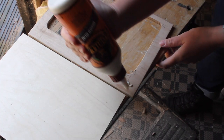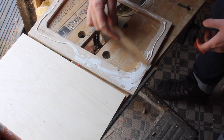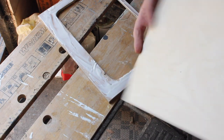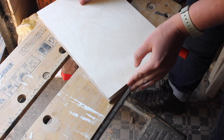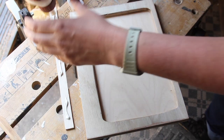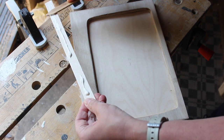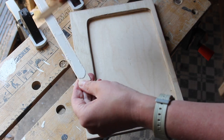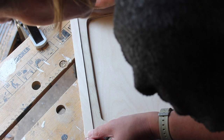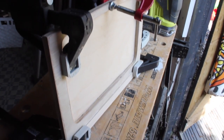Then it's time to start gluing it all together. Apply a generous amount of wood glue to the back of your thicker piece of ply, spread it out, and line up one of your thinner pieces of ply — make sure the prettiest looking side is on the inside of this laptop. Pop it on top and make sure it all lines up perfectly. Flip your laptop over. I'm also gonna glue the 2 centimeter strip to the back of the laptop. Apply the glue, spread it out, line it up to the back bit where you have 4 centimeters of thick ply. Make sure it lines up perfectly, then clamp it all together and leave it clamped for a few hours so the glue starts curing.